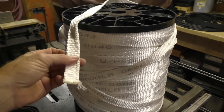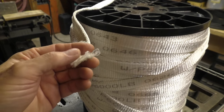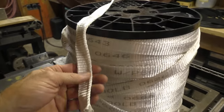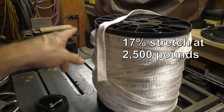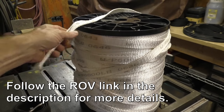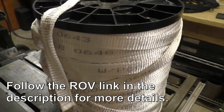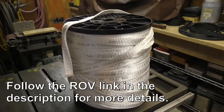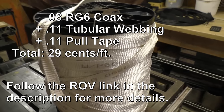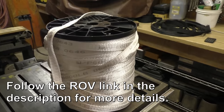This showed up today: 6,000-pound polyester fiber pull tape, actually used for pulling cable through conduit. We're going to try to put this inside our ROV cable. It has some stretch to it, but the thinking is to wrap the coax or cat-5 around it so that stretch goes along with this without breaking it. It's a cheap solution — we're still under 60 cents a foot, and that's where we want to stay. Going above this would mean something like a UHMW fiber high-tech line, and that pushes it up to a dollar a foot.